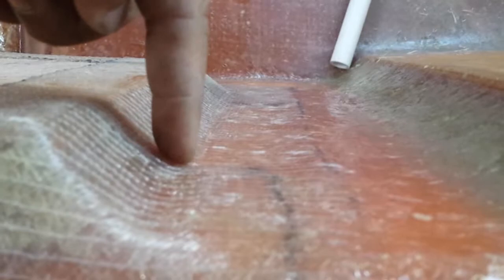Okay, now this is perfect. This should go into the fiberglassing institute. This is a perfect example of how your fillet should be. This edge is routed and your fillet comes down and slopes onto the hull. Whereas this side, it came down and had an angle right here. It wasn't a hard angle, but it was still an angle. So this way of doing it with the spoon, doing it with Betty, is a must. I would say go with Betty.